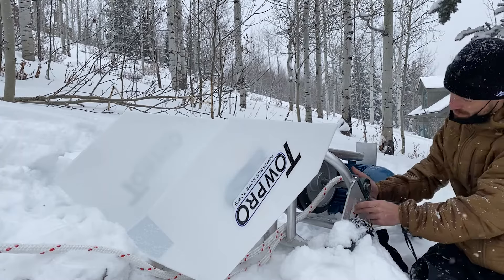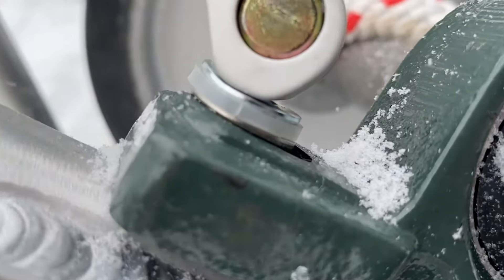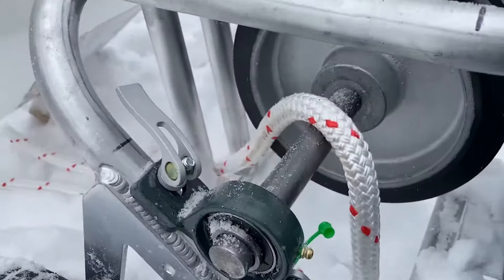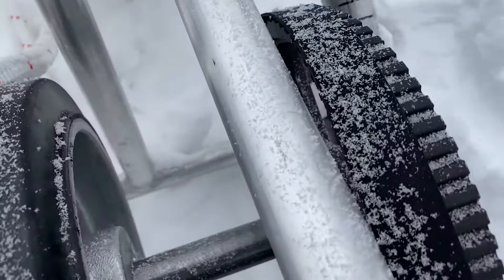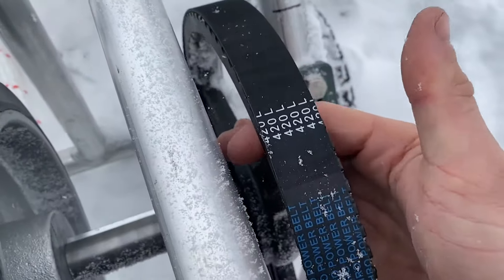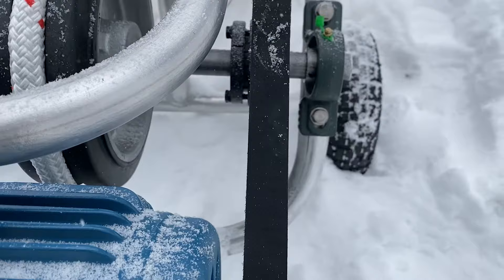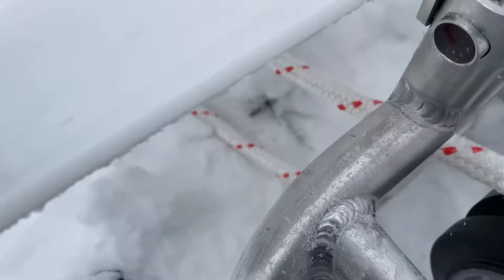Careful not to over-tighten. When you put the quick release back in position, just set it back in place. Once reassembled, the washer order is: washer, nylon, and then another steel washer. On the bottom side you'll see the bolt head and a washer. Then take the rope and place it in the v-notch. When you take the axle and move it out of position, the belt might come off — just spin it a little bit manually, careful not to get your hands caught, and it should realign itself. Make sure all the teeth are engaging, belt alignment looks good, and the rope is passing all the way through the notch. Don't start on a splice. Close your lid back up.